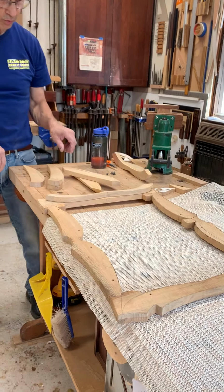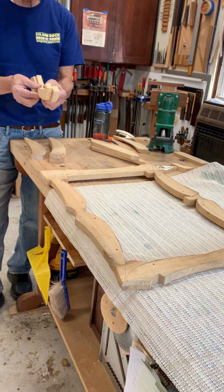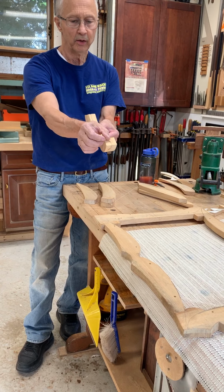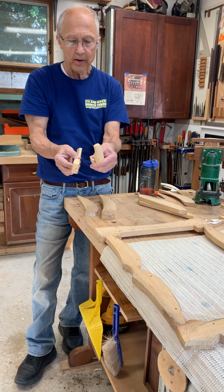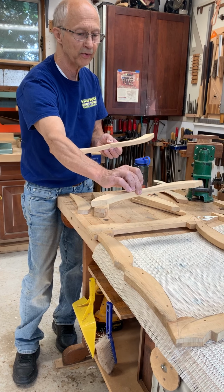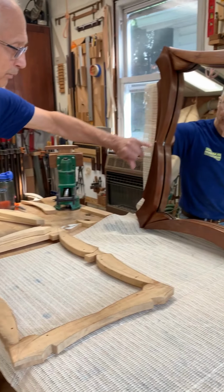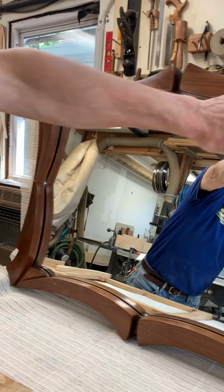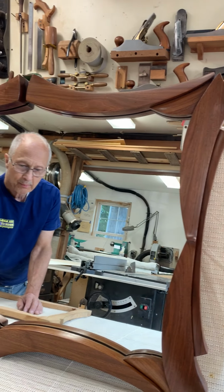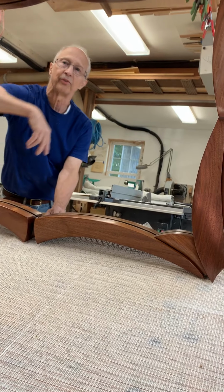One of the things I do often is book match, meaning I normally take a nice piece with similar grain, cut down the center, and now I have 2 pieces. If I open up this way, I have 2 pieces like that. So now this grain and this grain match. That's exactly what I did with this piece and over here with this piece. So now those 2 pieces really match. I did the same thing with this piece and vice versa with those pieces.